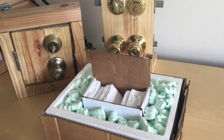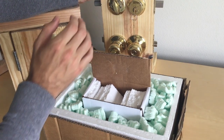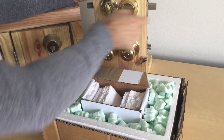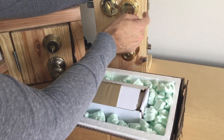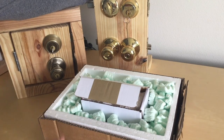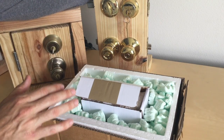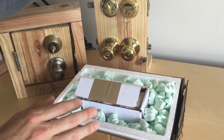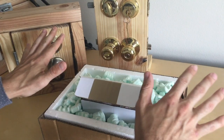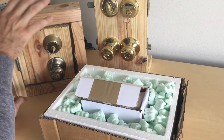Watch the video I'm going to reference here. It's a little grainy, a couple years old, and a guy takes a training stand like this and runs the magnet over the top, and the deadbolt magically gets sucked into the door — really cool. That video is legit; it works in that specific setting with a training stand, without a real door frame, without a metal door. We're going to go into reasons why it doesn't work in the field, and how we can use this to our advantage even if it doesn't fully work.